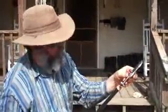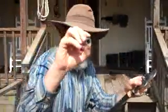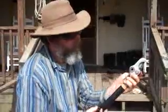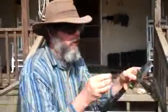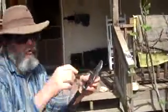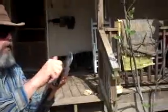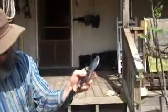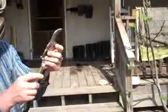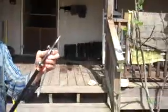And another thing you need to know is that they'll always have a washer on something. The washer does not go on the head of the bolt. It goes on the nut. So once your shaft is through there, you put your washer on, then you put the nut on. And these nuts will always have a side that's some kind of a locking deal, which means that you're going to have to put them so that the locking part is out.